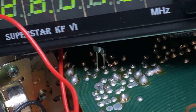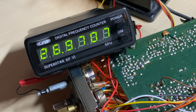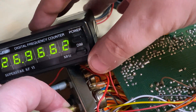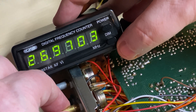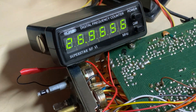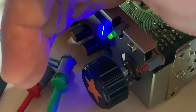So I'll try that again. Sure enough, we switch it on now and the shift is now working, and we're now 5 kHz high — which you would expect because I'd aligned everything with it 5 kHz below. And the LED's working — what a surprise!